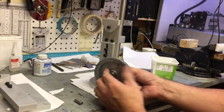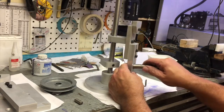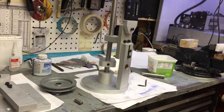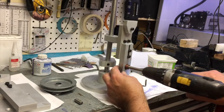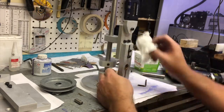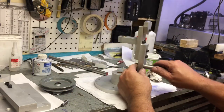You can see that the bushing in the lower strut is tight and needs to be honed out. I noticed that my sandpaper is loaded up with brass, so I'm washing it off with some alcohol. The paper doesn't need to be changed — it just needs to be cleaned. A wire brush, some alcohol, a rag — many ways to do it.